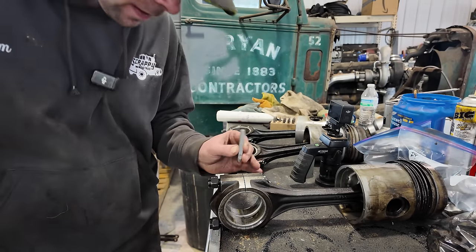We'll be able to get that copper ring off probably by doing that and getting it some heat. I didn't want to hurt those. You can still buy these from Cat, but they're $138 a piece, which I can't bring myself to spend on them. I really don't think this is a Cat piston — I think this is some sort of aftermarket deal. WMW on that side with the A1125 part number — the aftermarket big bore kit. We've got to pull this other head off so we can get the rest of the sleeves out.